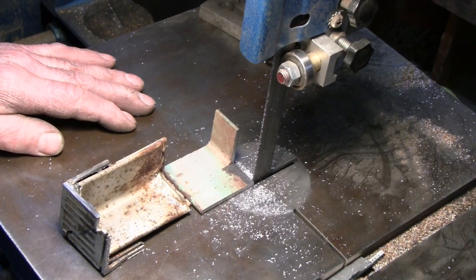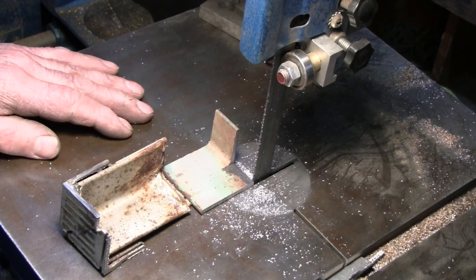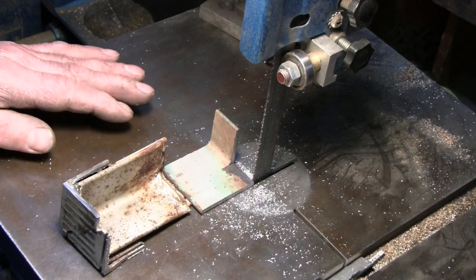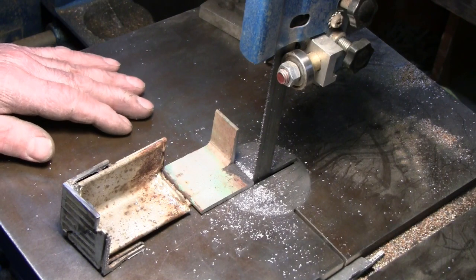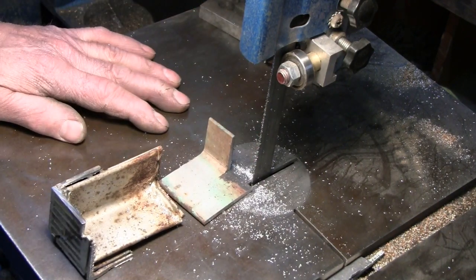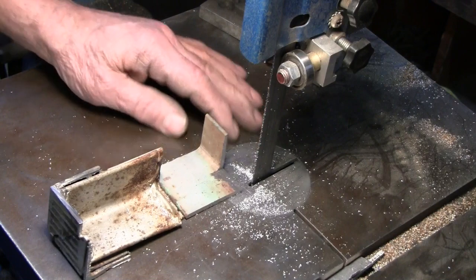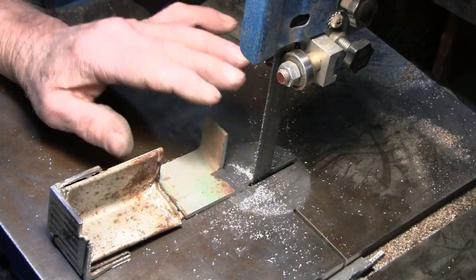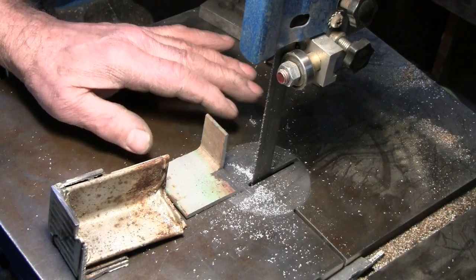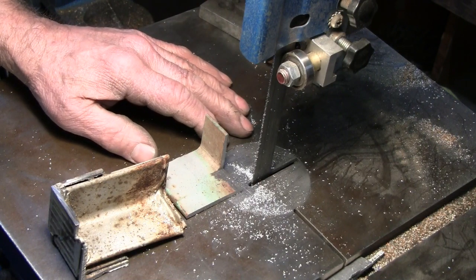For the moment, I'm satisfied with this. I need to practice silver soldering. I've got a junk blade I can cut up and practice making joints on, and try to get that technique down. But this joint is holding solid enough to do the work, and I think if I get the belt to hold and not slip, it'll pull that questionable spot through the metal here and keep cutting instead of stopping. So we'll take a look at that in the next video.